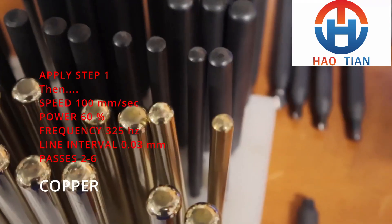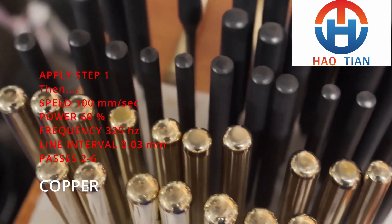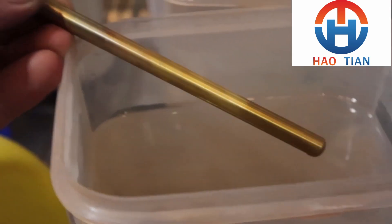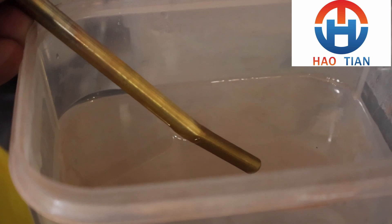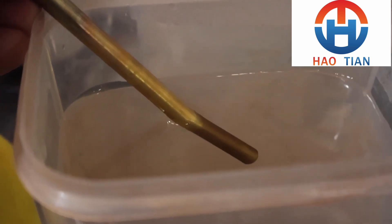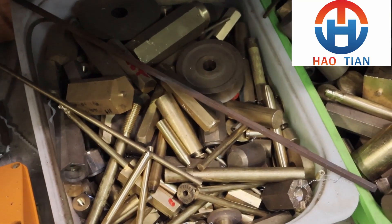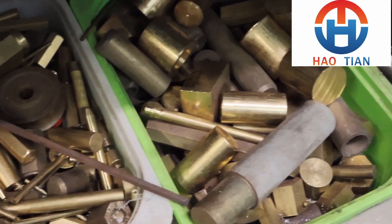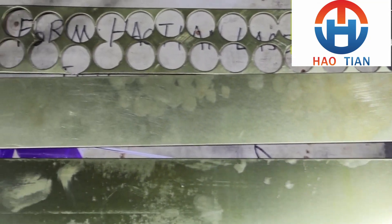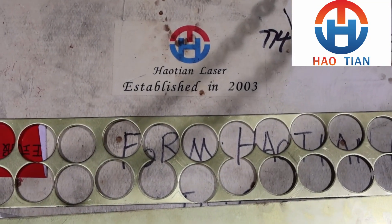How do you prepare your brass? It's not critical for this application, but people ask. I actually blacken my brass pretty much all the time — I deeply blacken it with Antica so it goes almost jet black. It's a commercial antiquing compound available in Australia; I think there are similar products elsewhere, so just find a brass blackening solution. I sandblast the brass and then blacken it according to the directions on the jar; it produces a deep dark grey out of solution and goes black later when we coat it. That said, it's not critical to get the colors — you can use scrap, polished brass, or whatever you want.